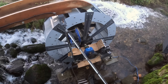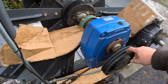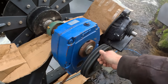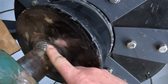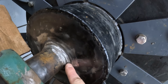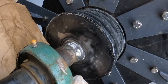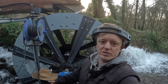Let me show you the breakdown. I decided to change over to V-belts because I was having belt alignment issues, and the customer changed them. After changing them the wheel was moving a bit slower — I'm not sure if I got the ratio wrong — but there was more torque put on the wheel. After a few days running like that, it actually broke the steel around here. Not the weld — the weld is fine — but the steel plate, this end plate, has sheared all the way around. I've ground it back with a die grinder to clean it up, and I'm about to weld it today. I'm going to weld that back and then weld an additional plate over it.